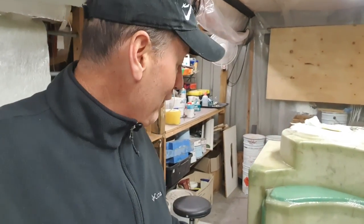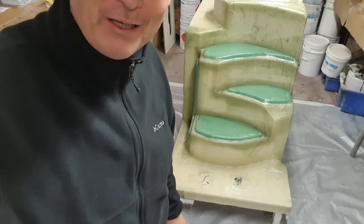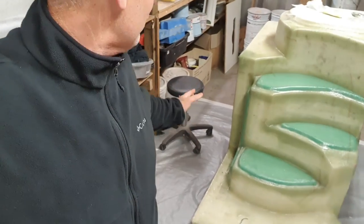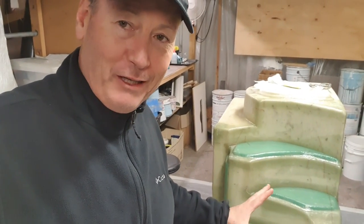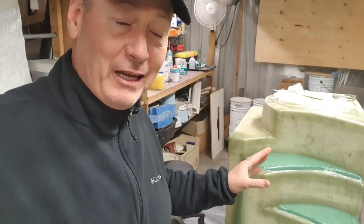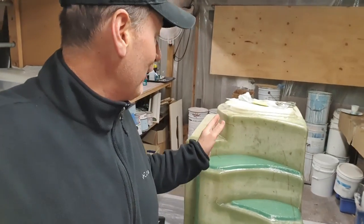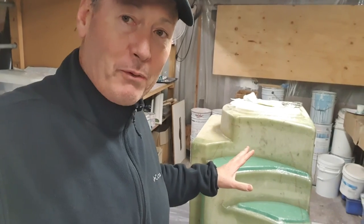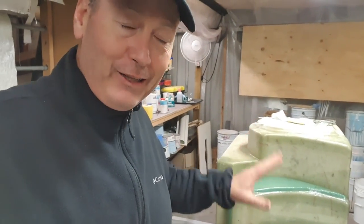I'm going to leave it tonight because it's dark and it's getting cold. Nothing's going to go off tonight, not in any hurry. So pretty much I've done all the face of that to a level of satisfaction. I'm going to come back in the morning and give it a sand, and while I've still got a chemical interaction, I'm going to then give it another layer of 600 double bias all over it, a layer of 300, and then another layer possibly of 1200 quad.